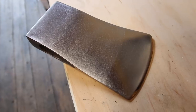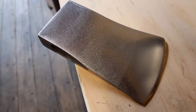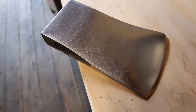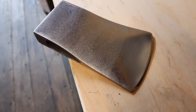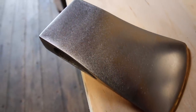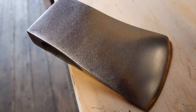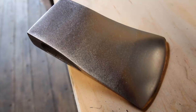I was not going to make a polishing video today — this video was about fixing the crack, which I already fixed — but I will make a polishing video because I'm doing it differently this time. I started off with a 50 grit disc, then went to the rotary sander with 80 grit sandpaper. As I said in a previous video, double your grit — so I'm going to 100, then 200, 400, 800, and finally 1500, and then it will be ready for polishing.